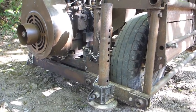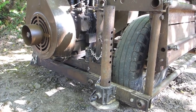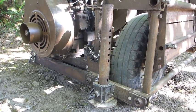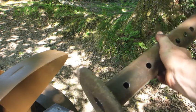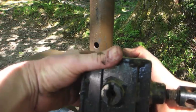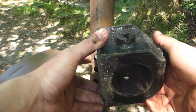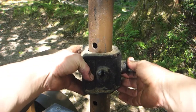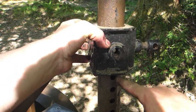There are loads of really smart and clever features on these saws. The legs aren't one of them. In doing my work on the legs I was keen to retain the original appearance of the machine rather than put something more modern on. Here's a very basic copy of the shape of the original leg bracket — it was a folded piece with a circular hole in the top and one in the bottom. The leg would just slide up and down and there'd be a pin underneath to set the height, and that was it.